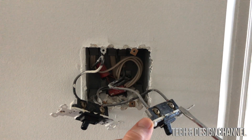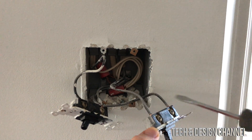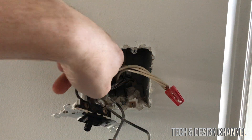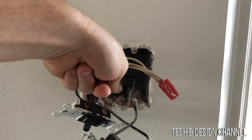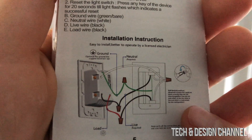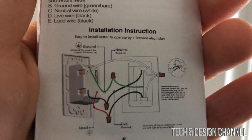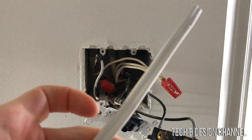We want to do this one at a time — set up this switch first, then go for the second one. You may notice some tricky connections, but this one just connects up to the other one, so it makes sense. Move all the wires around so you can see clearly what's in here. I can see my ground wires, but in my particular case they're very small, so I'll need to stretch that out and I'll need some extra wire to hook up my new connection.